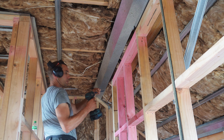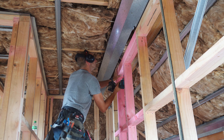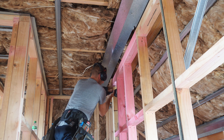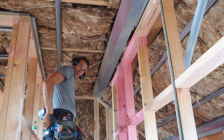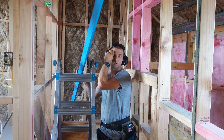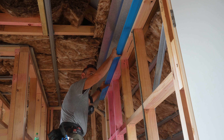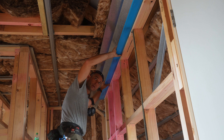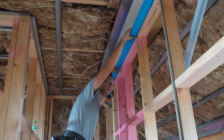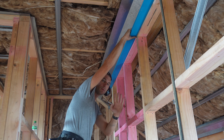I found a couple of stud locks, and that should not be moving. I'm happy with that. One more thing I'll check is that this wall is actually straight. We've got a little bit of a bend here just at this join, probably bowing a little bit out at the top and the centre here. And then you won't have a bend in the sheet right here - it'll be more gradual, and that'll be fine.